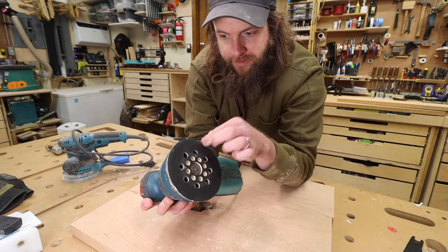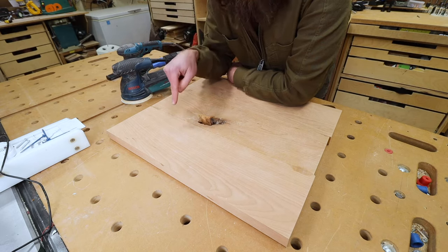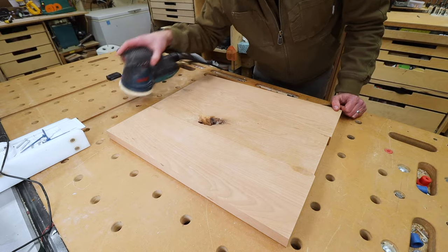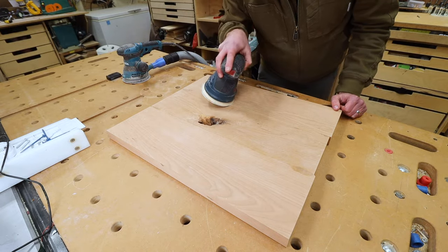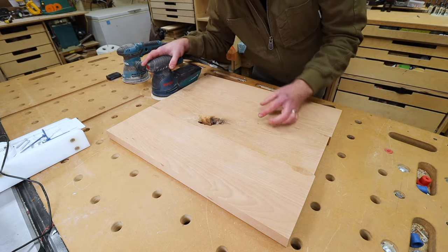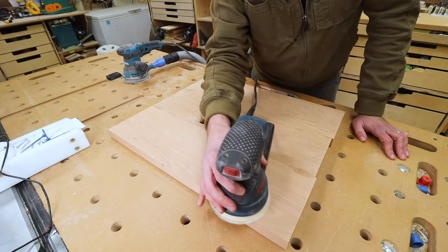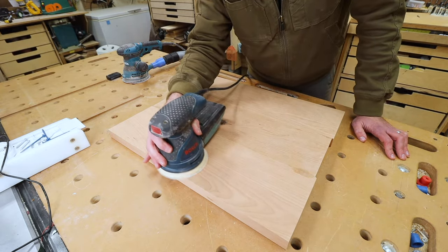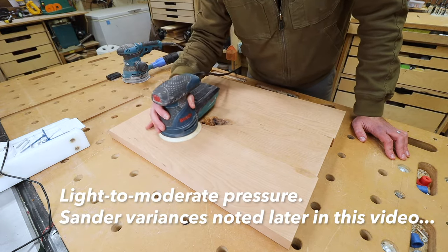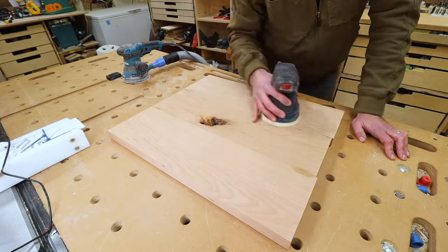So if you have a ring of hooks that don't grip the sandpaper, that's probably what you've been doing. I need to sand this panel — it's three boards and I can feel a ridge. Ten years ago I would have gone at an angle and dug in to go ahead and get that smooth. Now there would have been a dip, but there wouldn't be a ridge. Now that I'm older, I'll use 80-grit sandpaper to flatten the whole top, going slow but steady, as many times as it takes to get it nice and smooth — taking care of the ridge while making sure not to leave any dips.